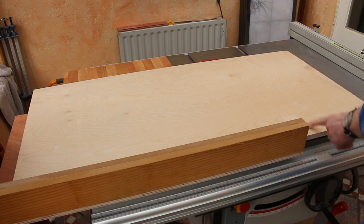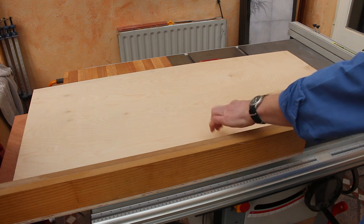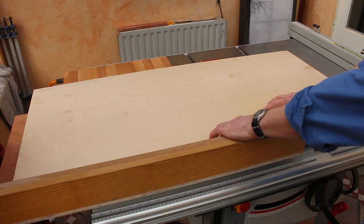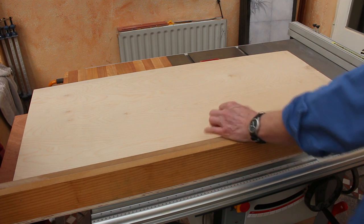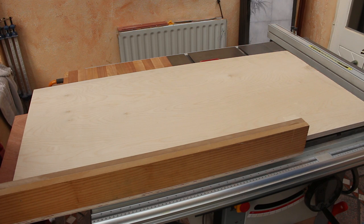If I do the calculations correctly, I should be able to give myself a few millimetres either side of the line in the middle. I've got to add up the widths and kerfs and make sure there's enough room, and get my first cut between the two. Then that will give me the opportunity to bring the rip fence in, set it to 30cm, and do everything properly.